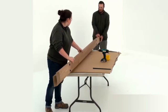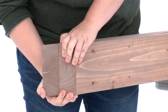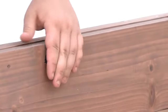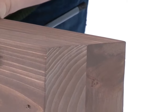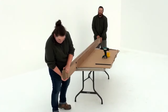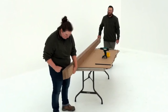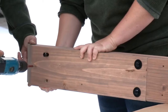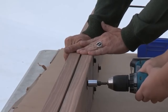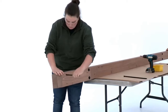To complete the short beam assembly, place two of the boards together with the longest one at the back. All the bolt holes should align. Insert long hex bolts temporarily to help with keeping the beams together. Positioned correctly, the mitered ends should be flush. Insert a screw to hold them in place. If the mitered end isn't flush on the other end, loosen all four hex bolts on the short beam end assembly, make the necessary adjustments, then insert a screw to hold the boards in place. Tighten the hex bolts before fastening the beam assemblies together with 18 wood screws, then remove the long hex bolts.